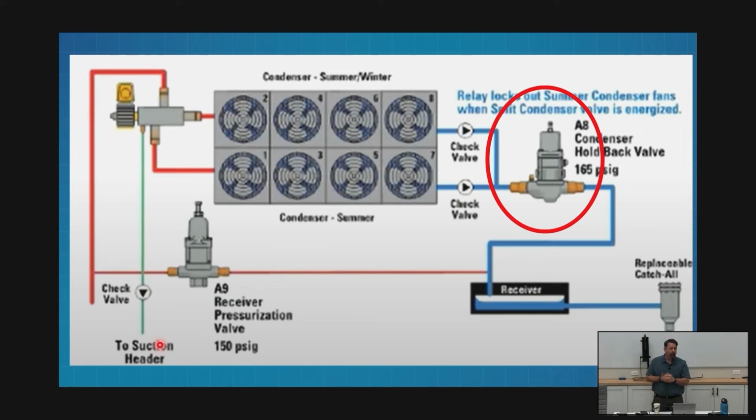We call this valve the holdback valve. Or we call it the drain regulator. It's another term that we use, right? What we're talking about is this pipe that comes out of my condenser, past those check valves we just looked at. We call that the drop leg. Whether these are the technically correct terms or not doesn't matter. That's what we call that pipe that comes out of my condenser and goes into my store, because traditionally my condenser is taller than my rack. So that liquid is dropping into my rack, and it looks like a leg. So that's why we use the term drop leg. But what we're actually talking about is a pipe that's 100% full of liquid. Maybe even subcooled a little bit.